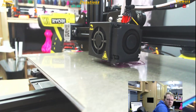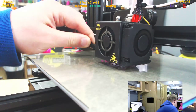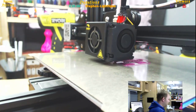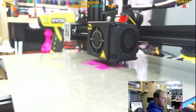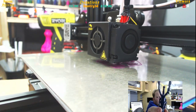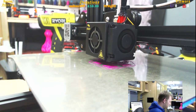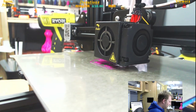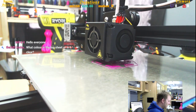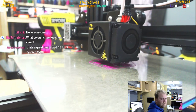So that's printing out quite nicely. Cools down enough. See, that's my issue with the Predator, is that it doesn't cool down the layers enough. I was printing this, and the layers on it are just rubbish, from the cooling. See, this is at a 0.8 nozzle. I managed to get the flow rate down, so one side of the wing was okay, but the other side was just still rubbish. Hence the reason I've got bigger fans.